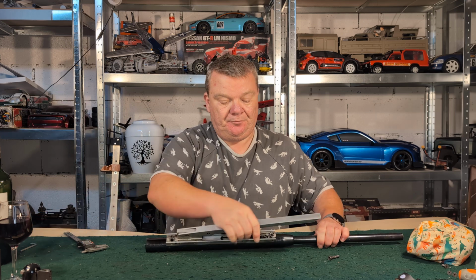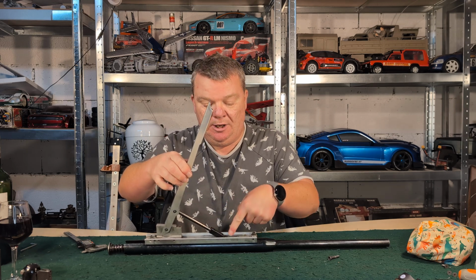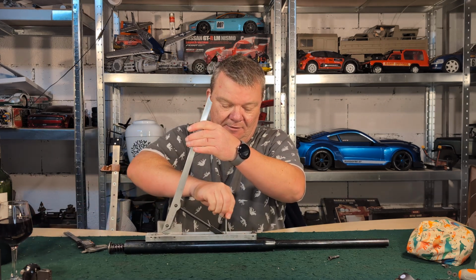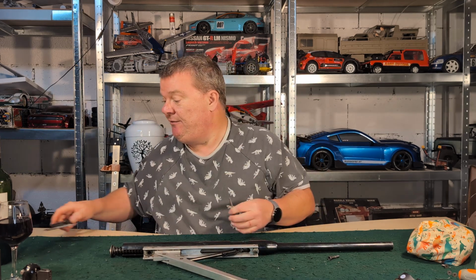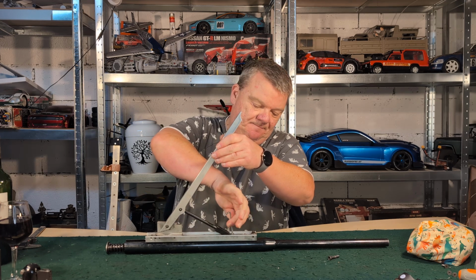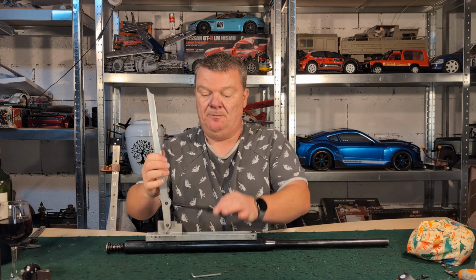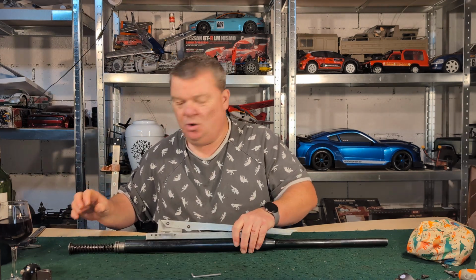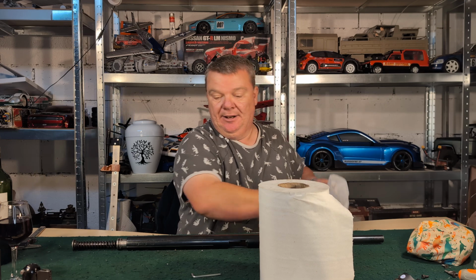So now we have, inside of here, this moves freely because there's no spring pressure. Inside of here we have the cocking link from the cocking arm, and you can see there's a cocking screw at the front there. So we now need an Allen key that will fit that, and that's this one here. I'm guessing he's going to be 4mm, 3.95. He is a 4mm Allen key, so we use him to undo that bolt there and remove that bolt, put him safely aside with the others. Now that arm and that link lift free, and we can push out everything towards the back. Oh, what a hooky mess. Let's get some tissue to lay it onto.